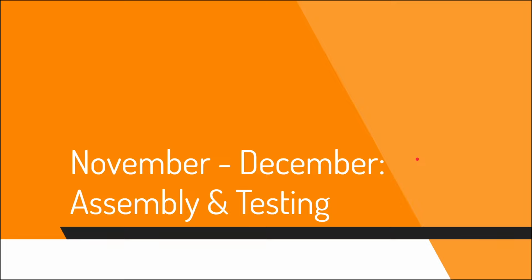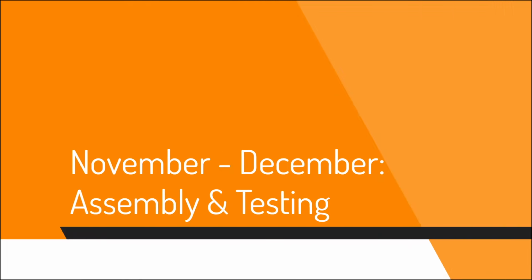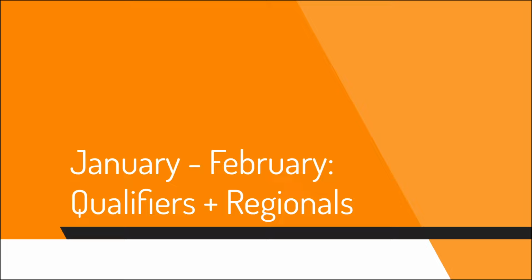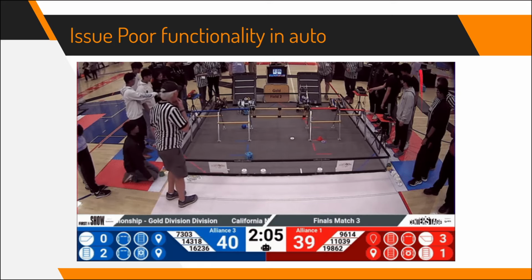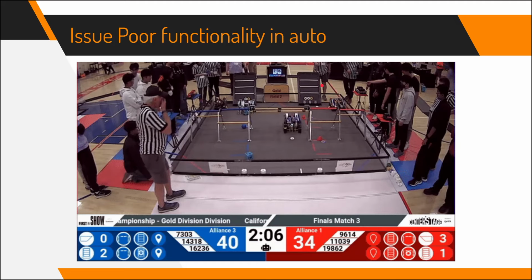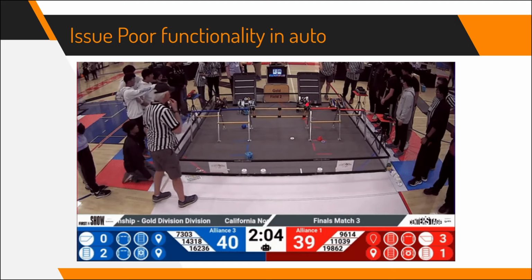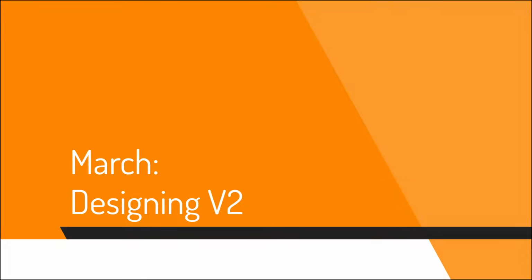From November to December, we did a lot of assembly and a lot of testing on V1 Outtake. We won't show that because there's nothing very interesting. In January to February, we participated in qualifiers and regionals, and from this real competition experience, we found a lot of issues with the Outtake. The first thing is you can see here that even with the compliant Outtake, it still hits the backdrop a bit too hard, and it knocks some pixels off during autonomous. That was the main issue, which was why we redesigned to V2.